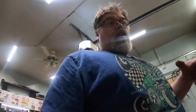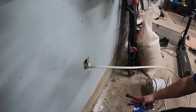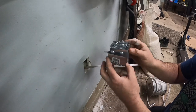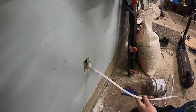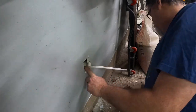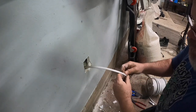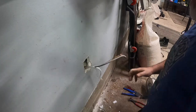Now we'll do the second plug together out here since you didn't see me do the outside part. Don't do this yourself unless you're 100% sure of what you're doing. These are the boxes I bought — they're designed so that if you don't want to find a stud, you just cut a hole and push this in; it snaps and locks the box in. I'll leave myself some extra wire. We'll just peel the sheathing from the end — you can just pull it back yourself.